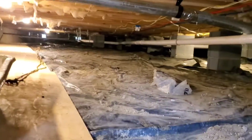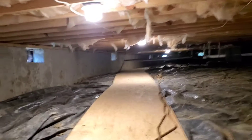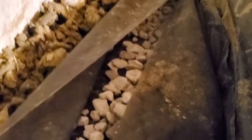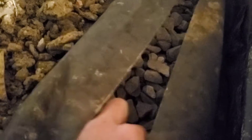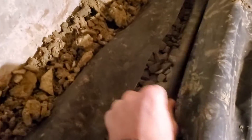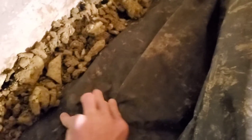It's a little after three o'clock this afternoon, guys, and before I get any more progress made on that trench, I want to go in here real quick and show you exactly how we do all this fabric and the pipe so that all of you will quit asking me. As we crawl in here and get on our little wooden road, I'm going to go back to the area we're working right now. You'll see over to my left that we've already got most of the rock in the trench, but look — you still see our fabric right there. See how we've got our flaps? You see this flap right here — look at me open it up. Down inside here is that four inch perforated pipe. We got all that buried, then you take your fabric here, you burrito all that together. You see how all that's completely burrito now? And once we're finished, it'll look like that right there.